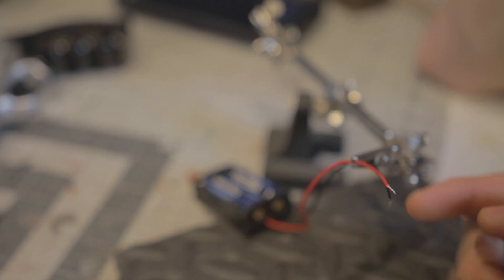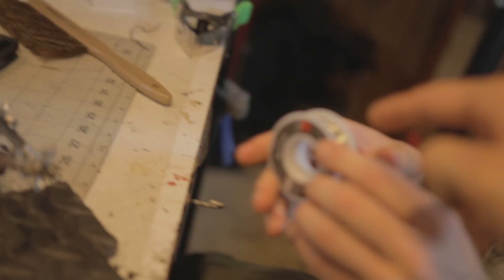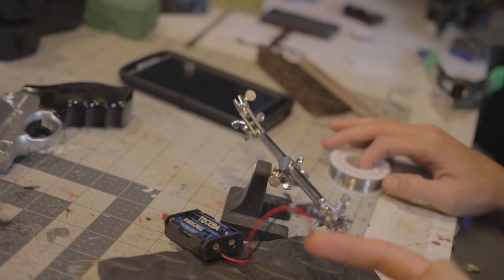So you have to take this and strip it back in here. I know it's hard because the wire tears so easily. After you've stripped this, just melt it over the wire — you basically just hold it and cover the wire with this, like giving it a coating. And then when you take your other wire, if you want to extend to it, you just put it to it and melt what's already on there and it gets stuck to the wire. Then you wrap it up in electrical tape.